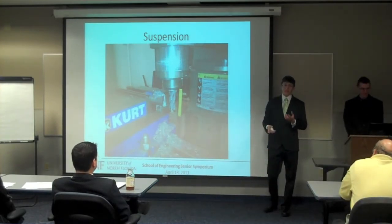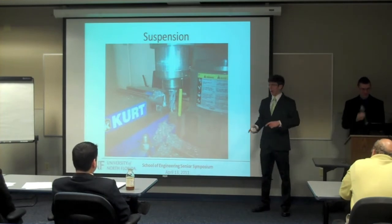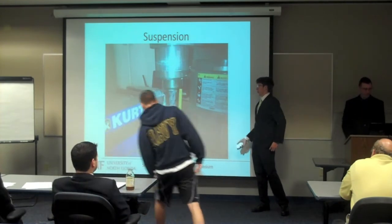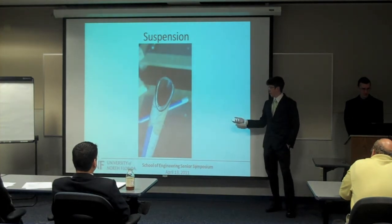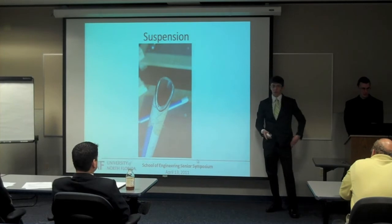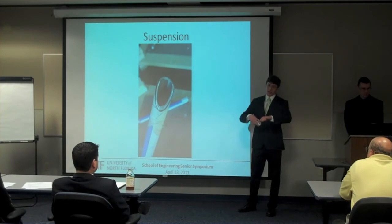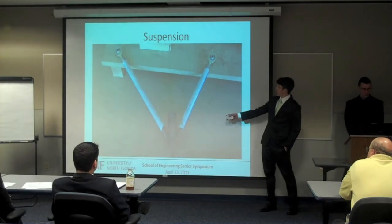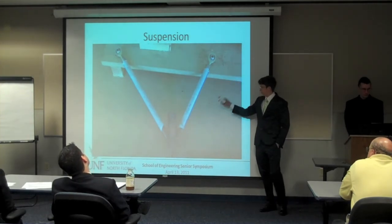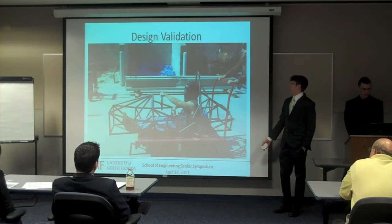This is the mill at UNF. The bearing cups were done using this. You have your bearing cup which is chromoly, and it's very hard to manufacture chromoly. It takes a lot of time — you have to take hundredths of an inch off, numerous passes, to get through it. This took the longest out of any of the processes we did. This is one of the finished A-arms. The way we went about this is the paper is printed out of SolidWorks. You print out your 2D sketch, wrap it around the tube with the profile already cut out, and then manually take a bench grinder and grind the profile down. Then check and fit, take a little off, check and fit, and keep doing that until it fits perfectly. This is the finished A-arm with the joints and the finished bearing cup.